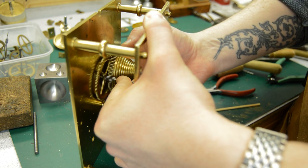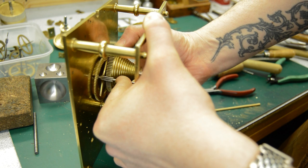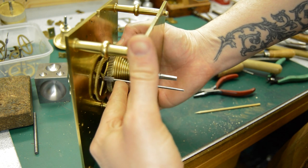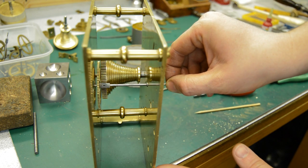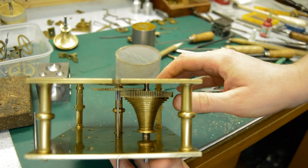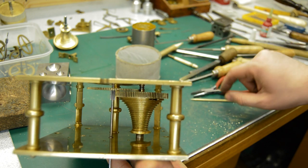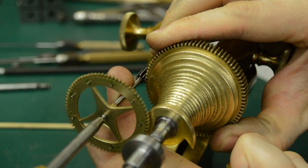You will then be able to feel the true depth. It should feel as smooth as you can possibly get it — not notchy at all. Apply a light pressure and you'll be able to feel that tooth coming all the way through engagement; it should feel really silky smooth. Just verifying that there's end shake and I'm happy. It's also important to check that there are no clashes — so as things are at the extremities of their end shake, nothing can come into contact, because that's a common cause of faults: wheels dragging against the back of other wheels and so forth.